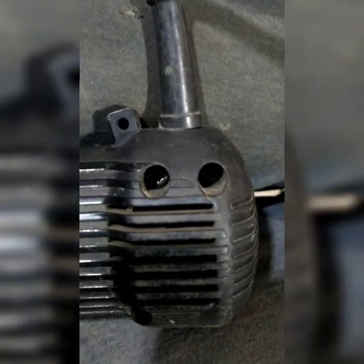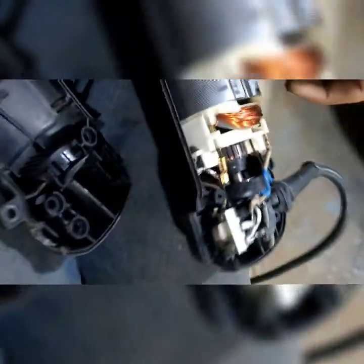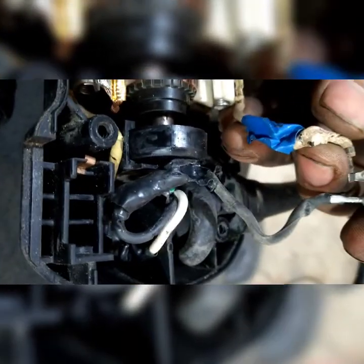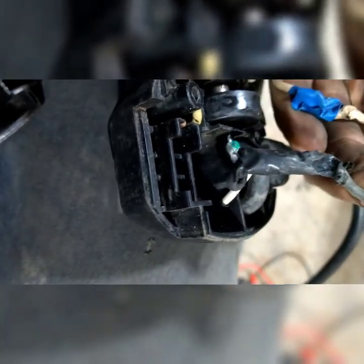See everything. I'll plug power to it and then trace the power to see where it stops. So from what I can see on my Rotozip unit, I think it's shorted. The two wires are melted together, I think. So I'm gonna try to fix it. Either they're shorted or they're broken — I think they're broken, because this is the whole switch and I don't see anything burned. I think they broke. So I'm just gonna solder some new stuff on it, see how it goes.